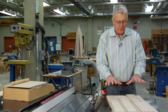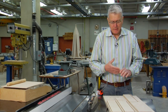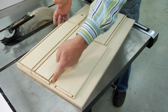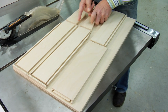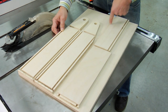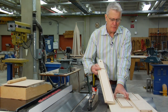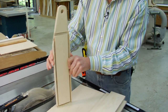Before we begin to cut our parts, I wanted to show you how we're going to do that. This is one of those things that comes with experience in planning how you're going to make your cuts. I've laid a sheet of plywood down here that I'm actually going to cut parts just like these out of, and I've laid these on to show you where they're going to come from. So essentially I'm going to make a cut right down here. I'm going to make it oversized. We know these sides are four inches, so this is a total of eight. When I actually cut these in half, I'm going to need a little bit of room for my blade kerf. I've got plenty over here, so I'm going to cut this at probably nine inches, and I'm going to leave it intact. I'm going to go ahead and cut it to length, but I'm going to leave it at nine inches so that when I run this through the router table, I've got a big piece to run through, rather than a little piece like this that's going to want to rock and roll on me.